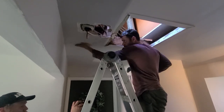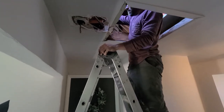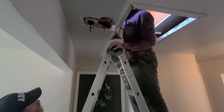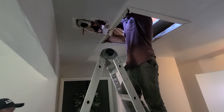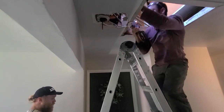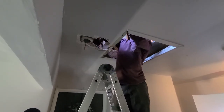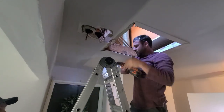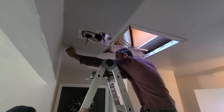So we were trying to do this whole line snapping thing. I'm just gonna make a mark flush with this thing about where I'm gonna go. So. Go. Now we know that's where the edge of the rafter is. I'll do the same thing over here. Yep. Alright, there you go. Ooh, just a lot of paint right there. Okay. So Ben, give me the chalk. You know where the edge of the rafter is now. Want to be about 3/4 of an inch short of it.